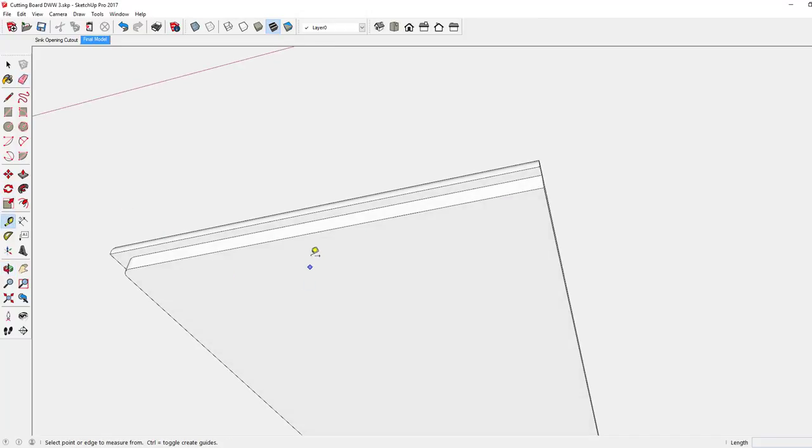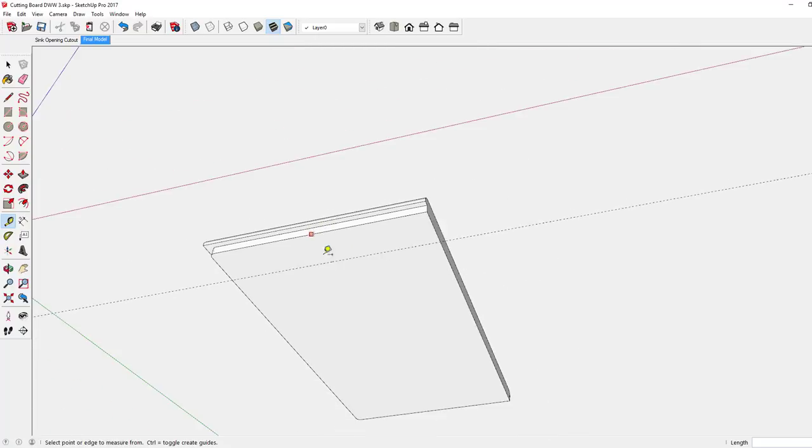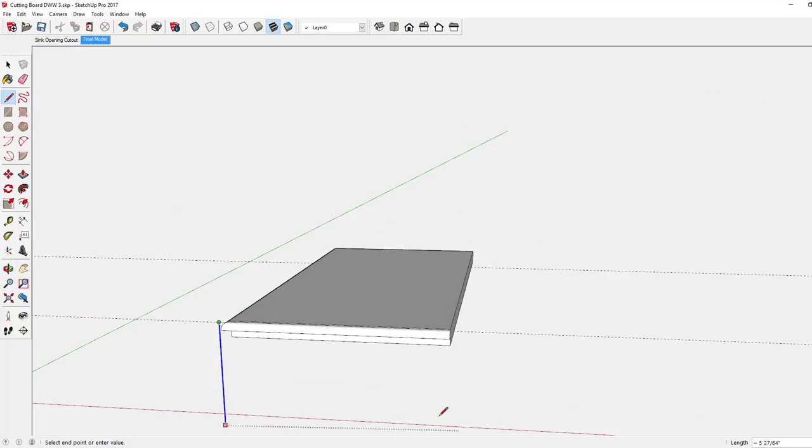And the breadboard, I'm going to make that 2 1/4 inches width. So off the edge here, that means 2 inches because the flange is 1/4 inch. So there's 2 inches on the underside. Do the same up at the top breadboard. And I need to slice off the breadboard shape, so I'll create a boundary here, a fence, a cutting surface.